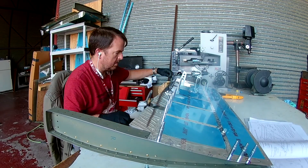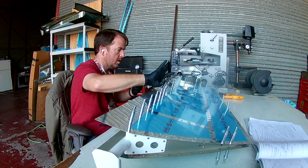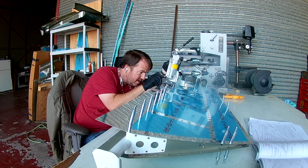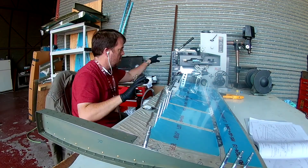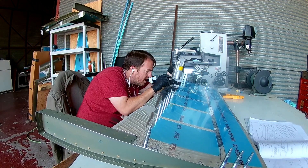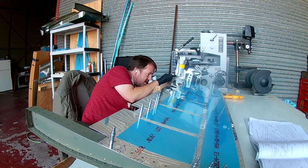And like I've done previously, to make sure that there's no stress in the skins or unidirectional stress, what I'm doing is starting from the middle of the spars, doing sets of three rivets on each side, then flipping over, catching up those rivets, and then doing three more towards the outside, then flipping and repeating.